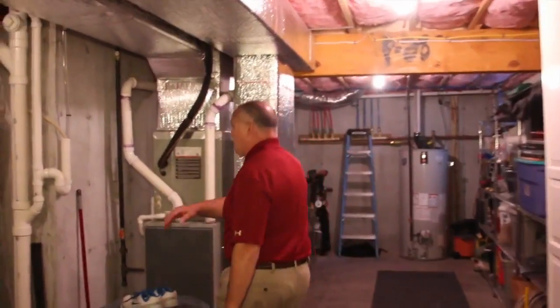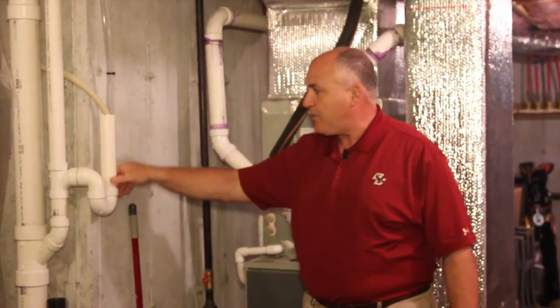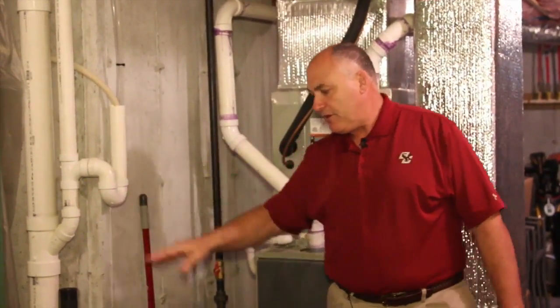Different temperatures throughout all different areas of the space. There were drains over here from the main drains coming down, so we just created a P-trap drain, pumped all the water, and then took the unit from the theater and put all the drains into here and everything drains outside through an indirect drain.